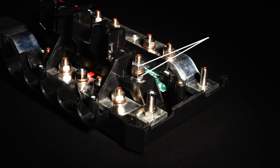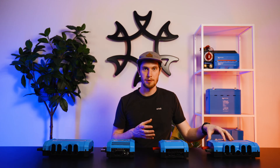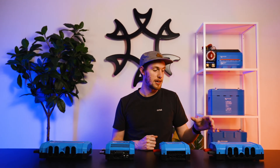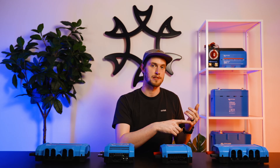An important note is that all of these nuts need to be torqued to the appropriate spec. That includes both of the nuts on the mega fuse holders in the middle — the top and the bottom one. These can also be bolted onto each other to expand the amount of distribution you need, with up to four Lynx distributors able to be bolted together while maintaining communication. It's also going to be able to link the distributor to either the shunt or the BMS, which gives LED fuse monitoring on the front of it. When paired with the Lynx BMS, you can also get fuse data over the Victron Connect app over Bluetooth. If you're not going to use the distributor with the BMS, we make a shim plate that allows you to directly bolt on a pro installer switch as well as the SmartShunt IP65 or the BMV 712 directly onto it, eradicating all of your cabling and making a cleaner, more compact install.